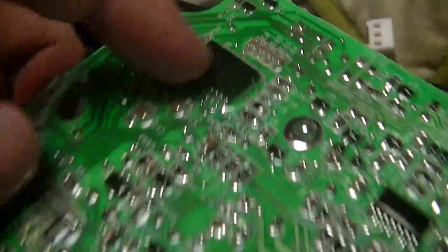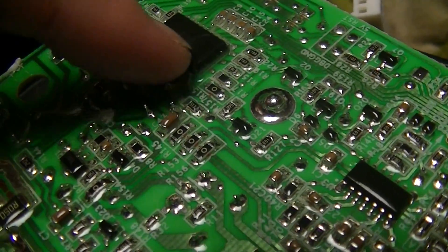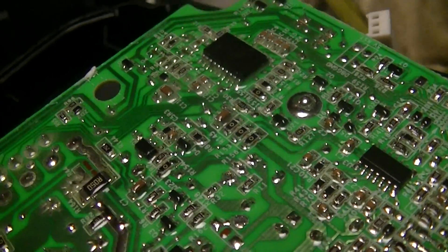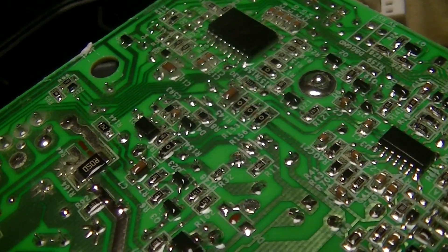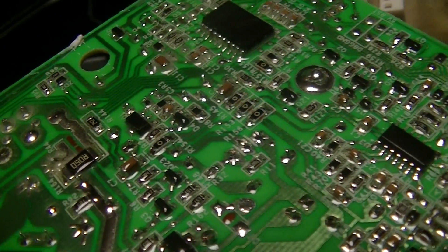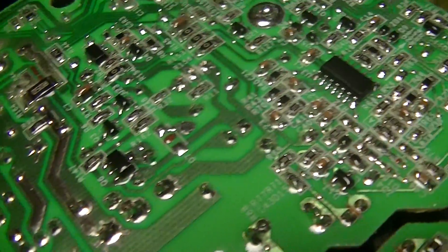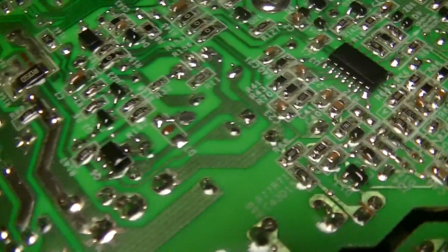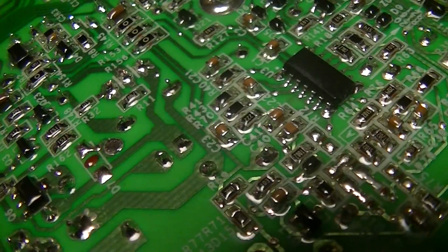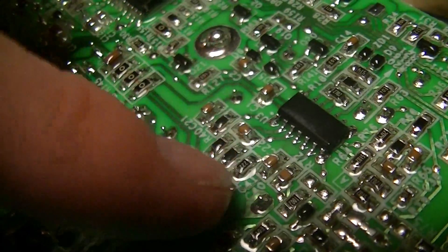There are two other devices, but I can't read any of the markings because of the fairly thick conformal coating on the board. The marking on one device means it's obviously going to be a microcontroller of some sort — it wouldn't be something like a programmable memory such as a fuse ROM, OTP ROM, EEPROM, or flash. The other device is probably an operational amplifier for input buffering or signal buffering and control. There are also random SOT-23 transistors and other passives.